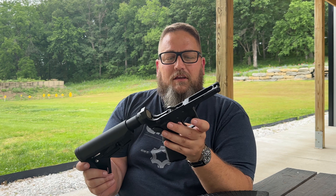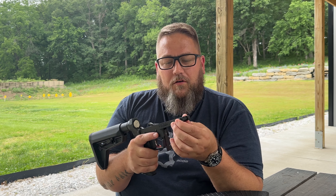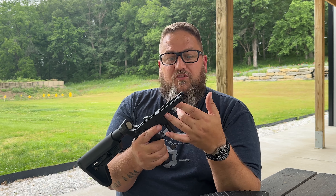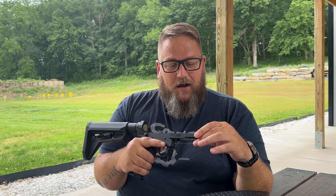Another feature that some people aren't necessarily familiar with on the Mark 47: there's actually a pin you can access via a set screw on this side, and there's also a pin that removes the magazine latch, accessible by a set screw on the other side. These are removable and replaceable parts because the receiver itself is made of aluminum, but you do get some people that want to run old surplus steel magazines. It's possibly going to introduce wear on the aluminum before it wears on the steel. So these little pins are made of steel — they're easily replaceable and typically just not going to wear as quickly as aluminum would. My gun's old school and I do have metal feed lips on some of my magazines and metal latches, and I've never had an issue with it.